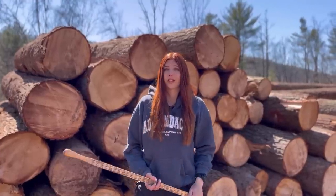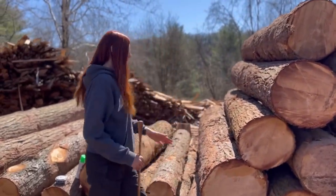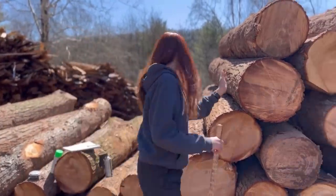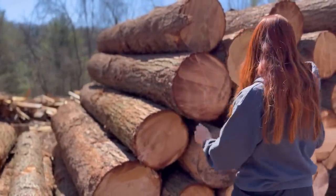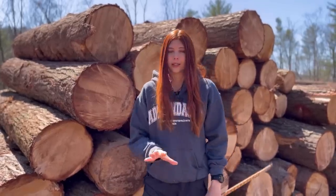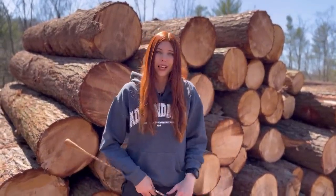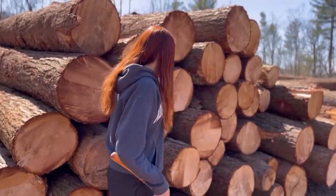There are also other things you want to account for when scaling. If a log is bowed — if it has a curve in it — you can take off one inch, and that takes kind of eyeing it down the side: is that a full inch that it dips or not? If it is, you're going to definitely want to take off for that, because bowed logs are not nearly the quality that a straight log is. You certainly don't want to pay full price for a log that isn't worth that.